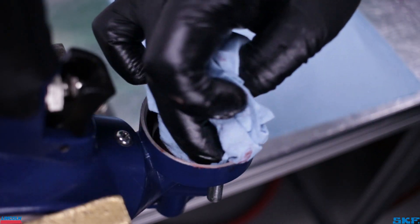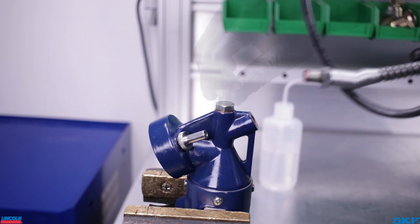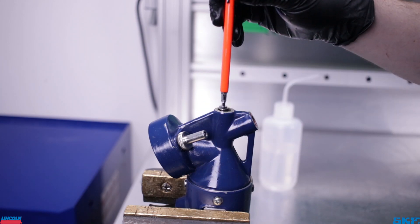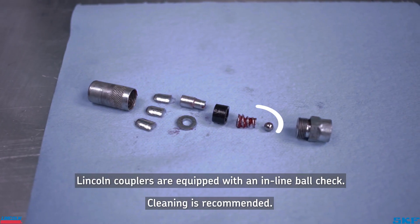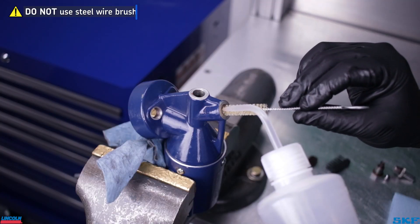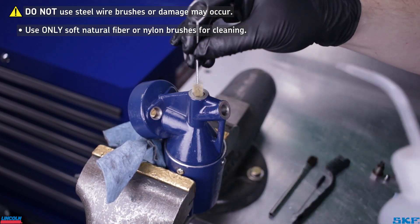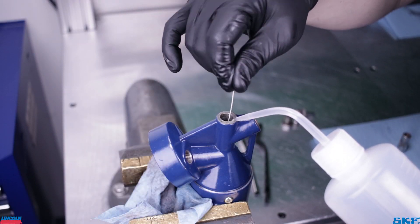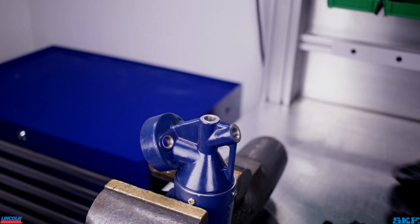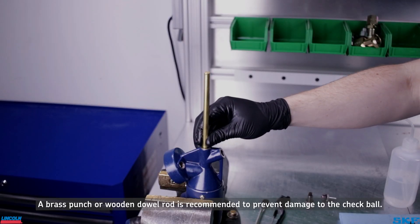For a full service cleaning, remove any remaining grease from the head cavity. Fully disassemble the head unit by removing the whip hose or extension and check assembly. The coupler may also be disassembled for cleaning and inspection. Use mineral spirits and nylon bristle brushes to thoroughly scrub the internal passages of the grease gun head to remove any built-up solids that may block the passages or hold the ball check open. The check ball may need to be reseated in the head cavity, which is accomplished with a light tap on the ball against the freshly cleaned check seat.